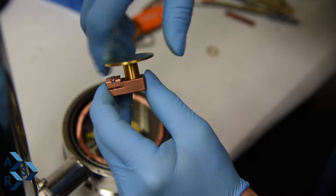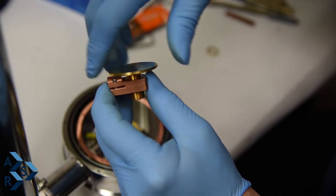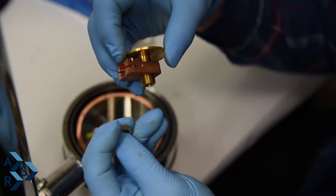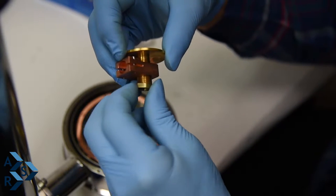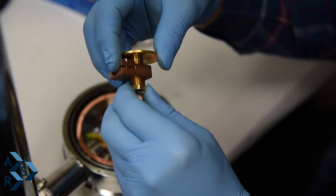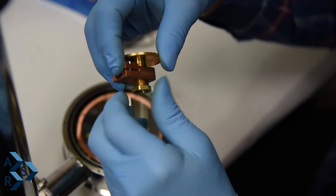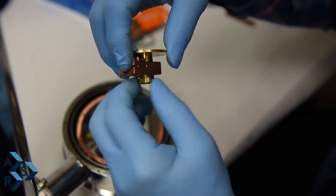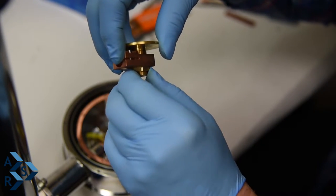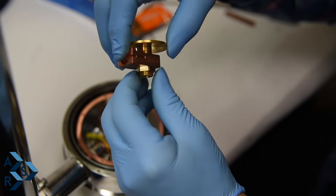The other thing is, if you go all the way through and you want to take your sample down to the bottom, we also will send you a retaining ring. It's really just a jam nut. So what you want to do then is, on the bottom side of your sample, put this nut on, and then you could tighten this nut tight. That will lock in your sample.